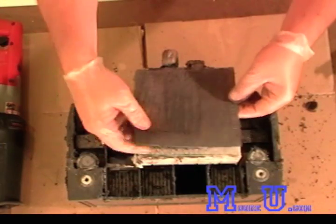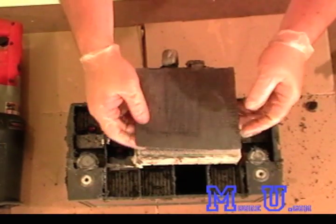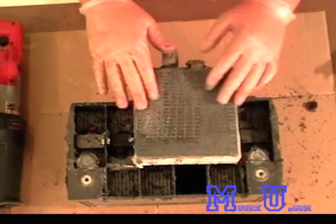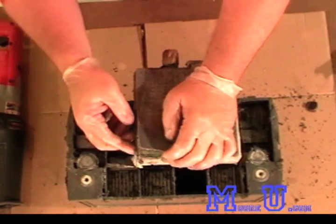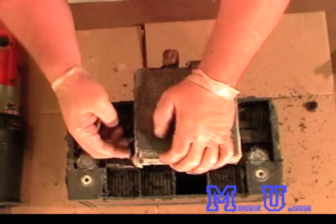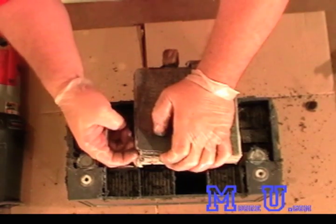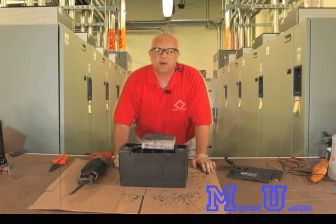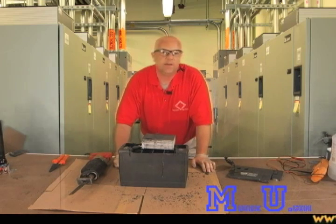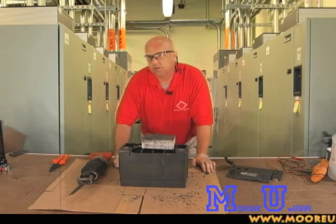There's a negative plate. This particular battery is for a UPS application, and as you notice, the plates are really thin. Why do you have the plates real thin? The big reason for that is for high rate discharges, such as what you would see in a UPS application — you want to have as much surface area as possible. In order to get a high rate discharge, meaning at like 15 minutes or less, you really want to stuff as much surface area as possible.